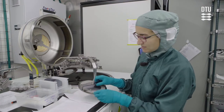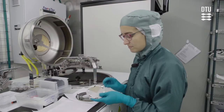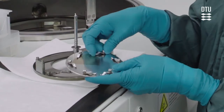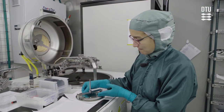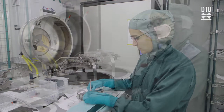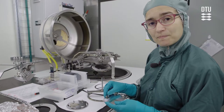And also fasten, in this case there is an insert for the 4-inch wafer, make sure that's also fastened. If you have small parts, small samples, then you can attach them with clips to one of these kinds of inserts that can then fit inside of the 4-inch wafer holder. Again, you need to fasten it with the clips.